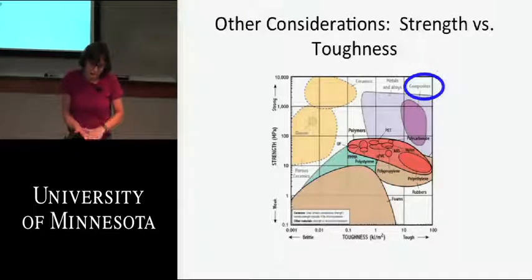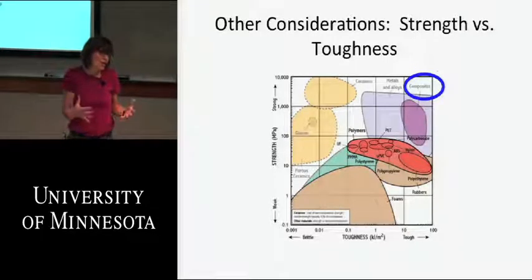So we've talked about stiffness, density, strength, and toughness. And of course, everything says you should do a composite, but a lot of that also is because composites are easier to work with too, which is not something we've talked about. In terms of making the shapes, they'd be a lot easier to work with. They're not so easy to manufacture in terms of getting the shape, but you can make the shape that you want. Like if you want to make a wing out of aluminum, the problem would be that it would be kind of heavy, and it's difficult to make that twisting. So airplane wings are made with the shape, but you don't see all the twisting going on, and composites lend themselves to that.